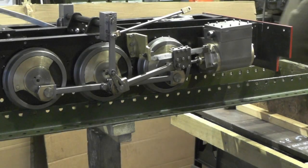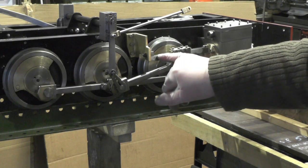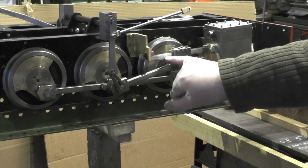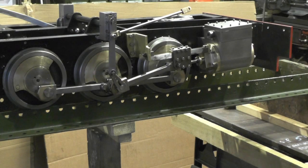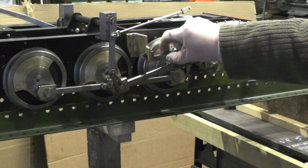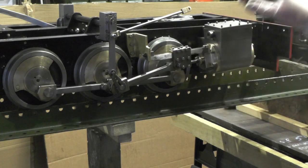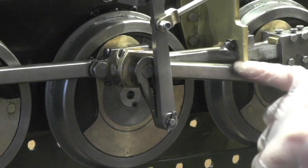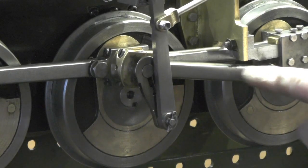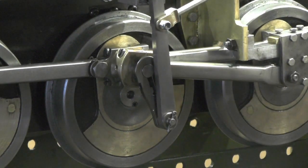I will point out a couple of things here for anybody that's just started on one of these or not as experienced as the professionals. If you look back at one of my videos, I only had 10 millimeter square bar for my slide bars, which is approximately 20 thou bigger overall than 3 eighths — so that's 10 thou each side. The clearance under your motion plate where your slide bar comes through: I've actually had to machine a chamfer, a little step and a chamfer on the slide bar so it misses the con rod.